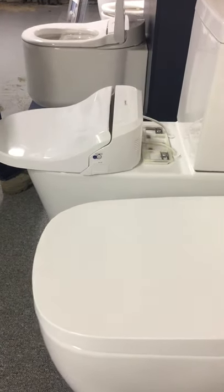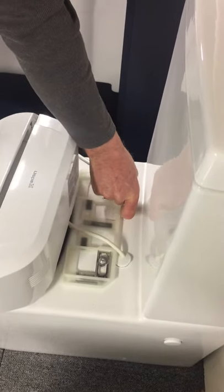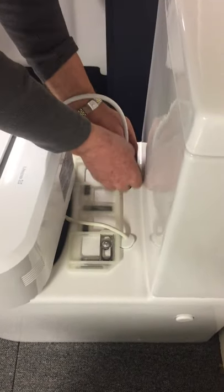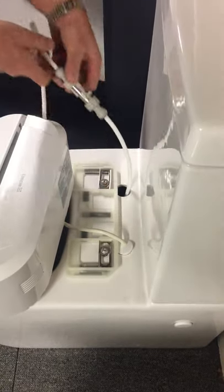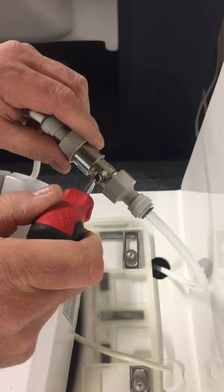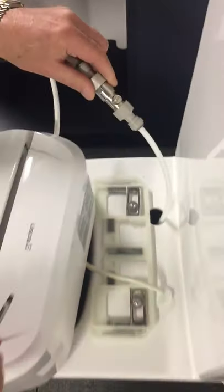Providing you've got the services integration kit installed, it's very simple. Remove the water isolator and pull out the caps, and the valve should then pull through the aperture. With your screwdriver, just turn the isolating ball valve straight across so it's across here — that's turned off the water.